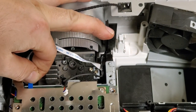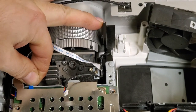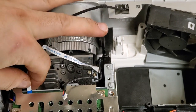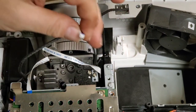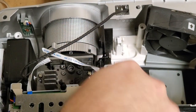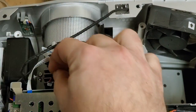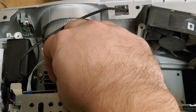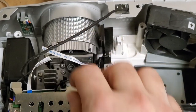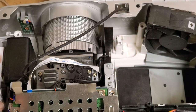That noise, that dee-dee-dee-dee-dee noise it was making, is a noise that I know I've heard before, and I want to say it's when the color wheel's plugged in backwards. But it also kind of sounds like when a ballast is trying to fire and it can't. But the way it goes into immediate failure, I seem to recall that these should try three times before giving up.